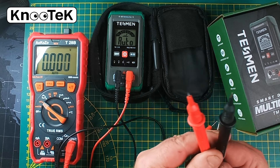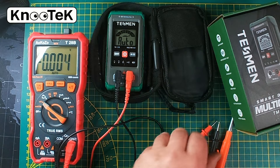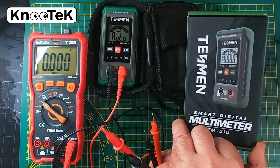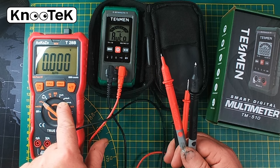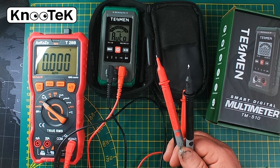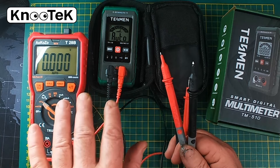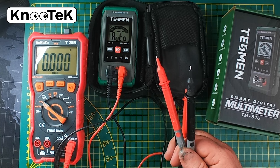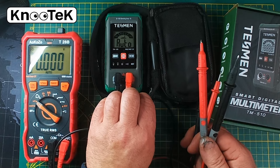So we've got two probes — the Testament has shorter pins and the AOK has longer pins. The Testament came with batteries, and not just any batteries — they were Duracell. When I first got the AOK, the batteries that came with it were cheap Chinese ones, and I wasn't certain they were alkaline, so I replaced them. Bear in mind whenever batteries could be in a device for a long period of time, put in alkaline batteries you trust — otherwise they could leak and damage the internal connections with acid.